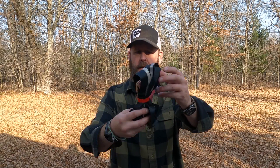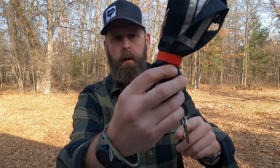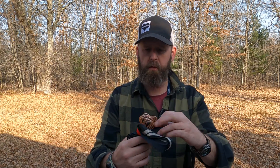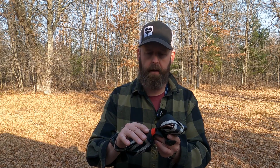Here's the Farad J antenna. I did a little mod to it where I just added a standard S-clip so I always have a little clip to put onto the Velcro binder to hold it all together. I've been using, with the testing that I did, a 6-foot length of RG-316. And I can already hear the keyboards typing right now that that's a high-loss coax — and you are right. I'm fine with that little bit of loss for what I gain in size and weight.